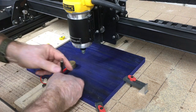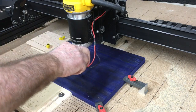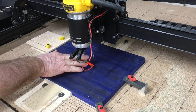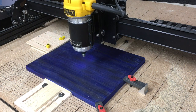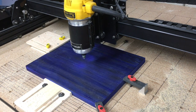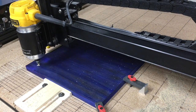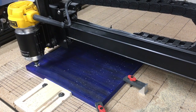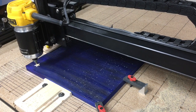The only thing I need to do is run the Z-probe to have that set where it needs to be, and then I'm ready to carve. Once it's secure, I simply jog the machine back eight inches and it brings it right back exactly to my XYZ home position for this particular project for each of the four unions. Then it goes ahead and starts to carve the next one, which does save a little bit of time. I continue this process through the second, third, and fourth union.